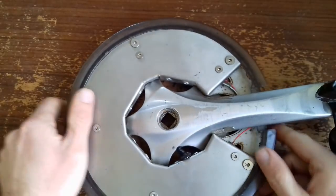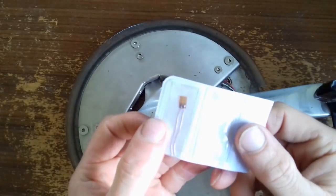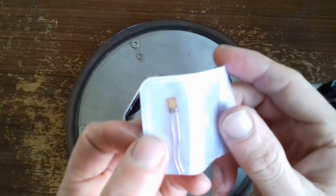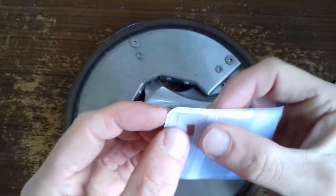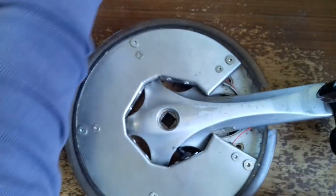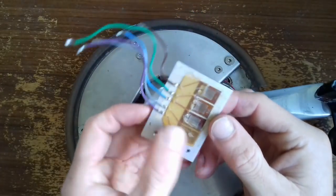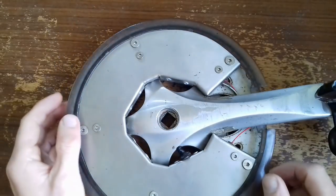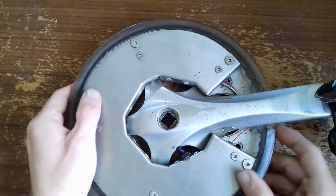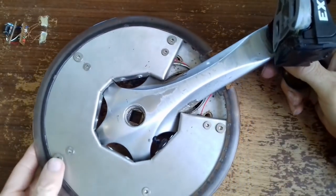The strain gauges I'm using are tiny. Here's an example one here — that's the one I use for testing soldering. Strain gauges are covered with wax like this first, and then a two-part adhesive, and on top of that some foil. That's about it to say about the outside of it.